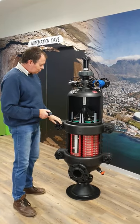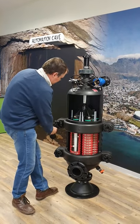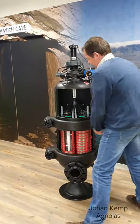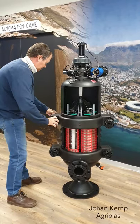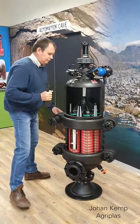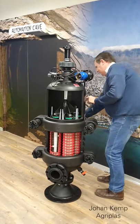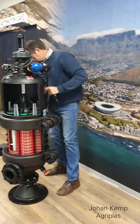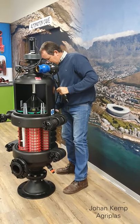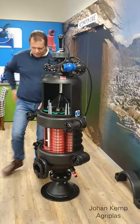You can now start to release the top clamps from the filter by using your provided spanner on the big nut. Then remove the big 12mm hydraulic pipe from the back and release the back clamp and the front clamp.